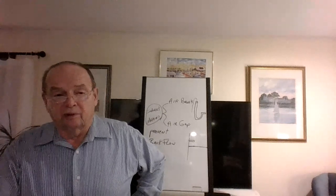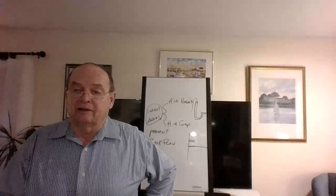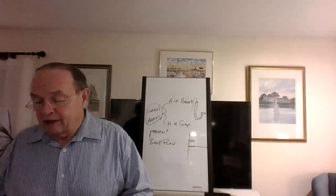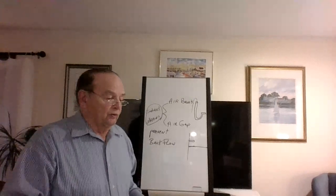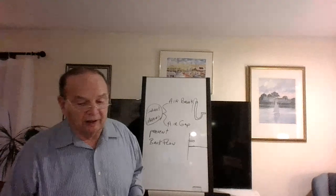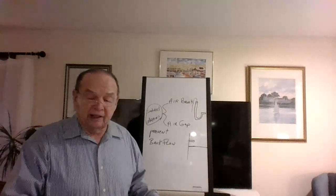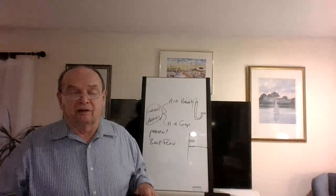One is a cesspool. Now, you've all heard the word cesspool. It's used to apply to other things, like if something is very corrupt or whatever, it's called a cesspool. What is a cesspool? A cesspool is like an ancient septic system. It was a hole in the ground, lined with stone, almost like a well. It looks almost like a well, except it's not as deep, and it's pretty wide. A pipe comes into it, and the sewage goes right into that hole and leaches out through the stone into the surrounding soil.